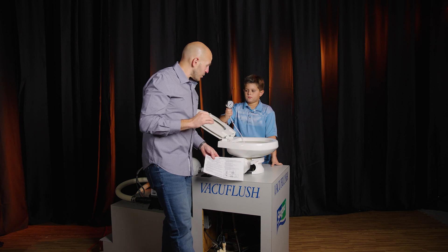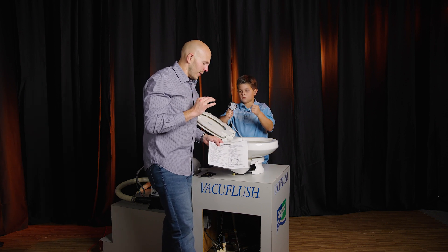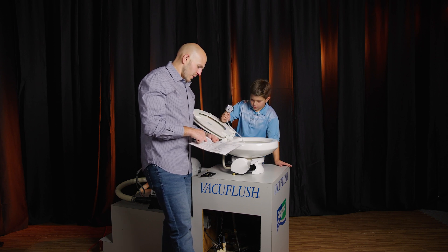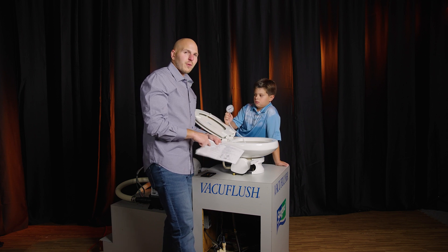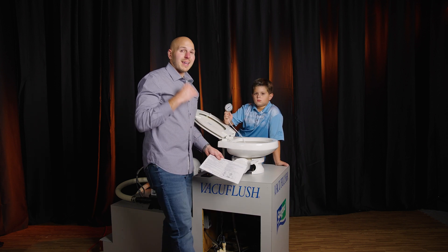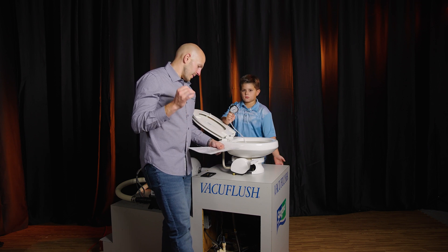The system is shut off. I usually wait about 15 to 30 seconds and then note down at what point the vacuum gauge shut off at. Now the instructions, like I said, are very well done. They break it down to about 30 minutes — we don't want the system to drop more than 0.3 inches of mercury, or Hg, on our gauge that's 0.3 in 30 minutes. That's basically the leak-down rate.